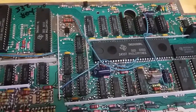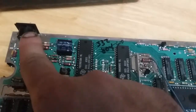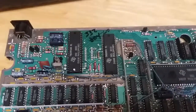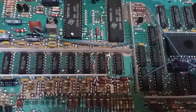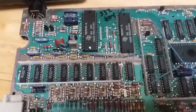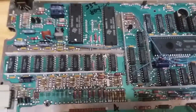and it turns out the 12 volt power wire, because it's kind of a weird design on the modulator, but there's a 12 volt line that goes from this to power the modulator, and it was actually just hanging on by a single thread of wire, and it wasn't getting enough signal strength to power the modulator. So when I set my voltmeter down on it, it actually made more contact, and it actually gave it a signal. So I have repaired that, and I'll show that off when I get this thing all put back together.